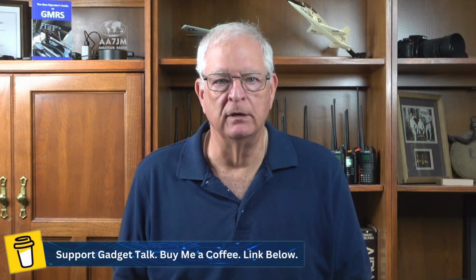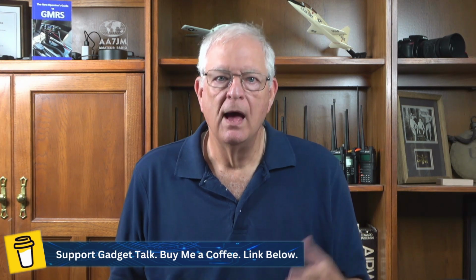You, like me, may have to spend another $6 or $8 for an adapter to convert your phone's USB-C connection into a 3.5mm socket for the APRS cable if your phone doesn't have a 3.5mm headphone jack. Obviously, your HT will be your transmitting device. Let's put all this together, do some basic configuration steps, and demo APRS using APRSDroid.